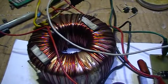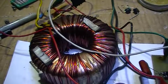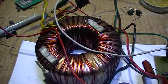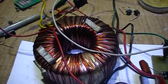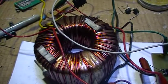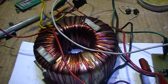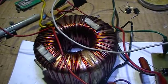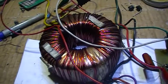A 12-volt car alternator peaks out at about 70 amps, so that's probably about where the core would saturate. If I strap two cores together, it should give me a capability in excess of 120-130 amps, which should be fine plus a short overload. I haven't seen that done before, so it might be interesting just to do a wee experiment with that.